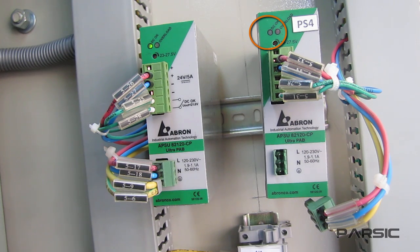How does this happen? The outputs of these power supplies are interconnected through a diode switching arrangement. This diode can detect a fault, isolate the primary supply from the system output, and then pass only the output of the other supply with no interruption of output power during the transition. So the diode is a key element for operating these two power supplies as a redundant system.